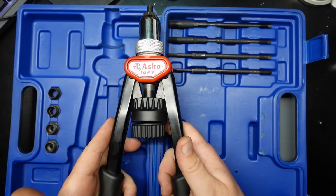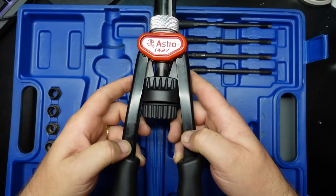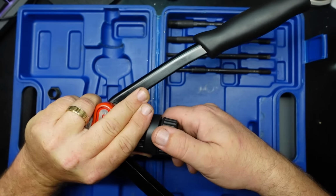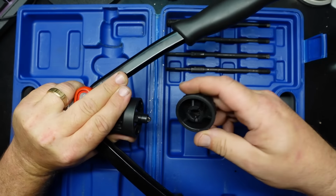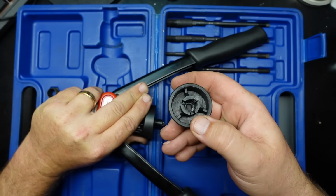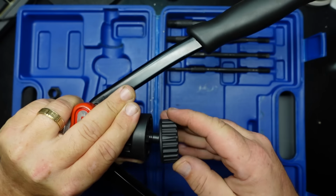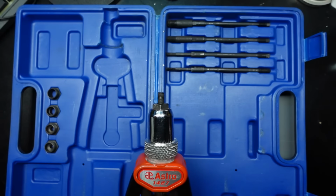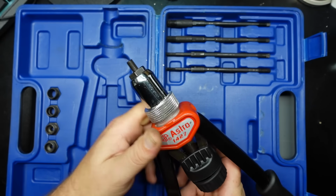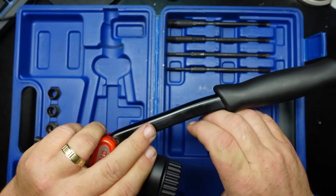It's just kind of floppy, flimsy. You got a little bit of a bend in the handle, again, from somebody who I lent it to. And yeah, the problem that happened with this is this right here. Now, this little thumb screw guy is supposed to be captured on here. There's a little metal insert that's supposed to turn this flat on this thing, so when you're done inserting the old rivet nut there, you take this guy and you spin it out, and it spins this end of it, and you remove the tool.